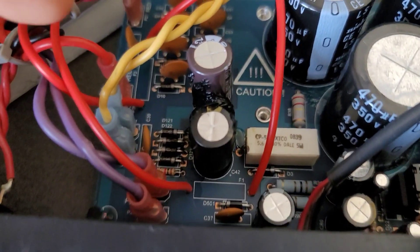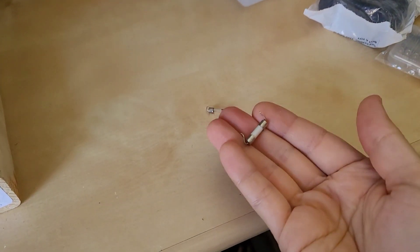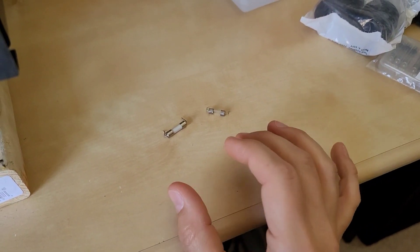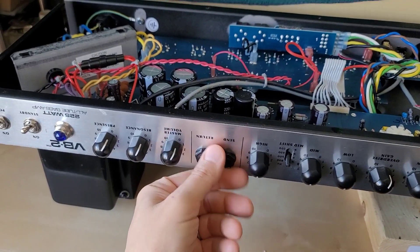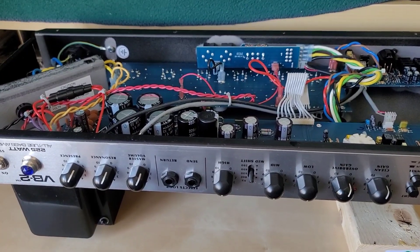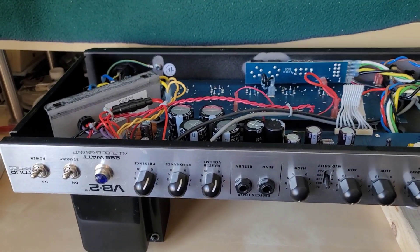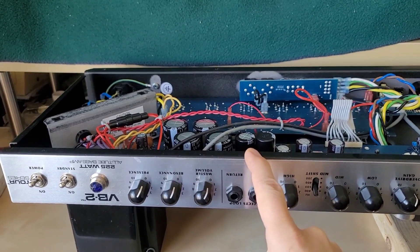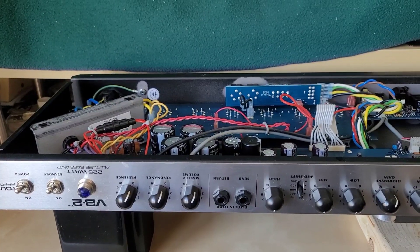What happened with Peavey on the production of this is they put a 1.5 amp slow blow fuse for F2, which is this fuse down here where it would have gone. The fuses actually look like this — they're soldered in, very small 5x15 millimeter type fuses, and they're a real pain to remove and replace because the entire circuit board has to be taken out, all the knobs taken apart, all the jacks removed, carefully lifted out, and then desoldered from the board. They did that for UL certification. Since we're well beyond its warranty, 1.5 amps is too small. The fix is to put a 1.6 amp slow blow, or you can go as high as 2 amp slow blow for the F2 high voltage fuse — that should give you enough headroom so that fuse won't pop prematurely under normal conditions.